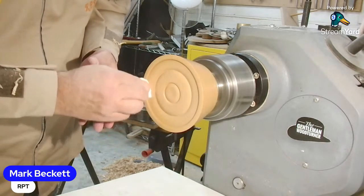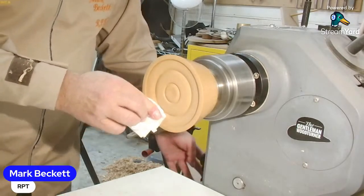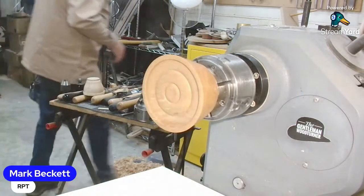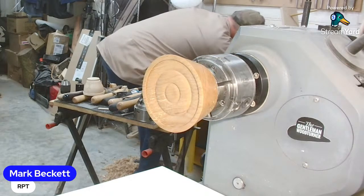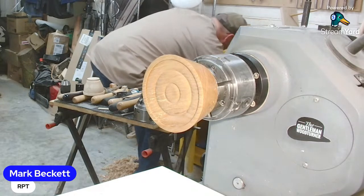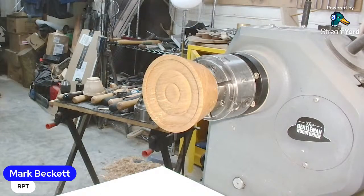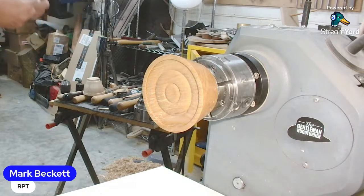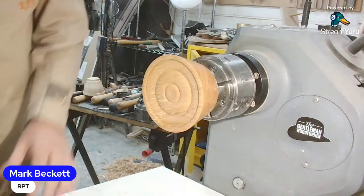Yeah. The M33 tends to be a standard thread size, certainly on larger lathes, or the more trade professional type lathes. The M33 seems to be the standard thread. The ones like Powermatic made in the States, they're all 1 1/4 8. All right. I didn't realize there was a different size for different countries, to be honest. I just presumed that everyone was the same. I know 1 1/4 8 used to be the original Nova lathes from New Zealand. The US use Imperial, so they don't tend to do metric anyway. Fair enough, yeah.